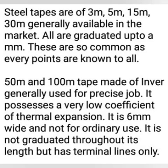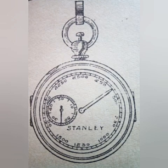To measure a distance by the direct method, we use a steel tape or the laser beam of a total station. Sometimes, a perambulator is also used for rapid determination of distances. All other instruments are obsolete. Yet, we have to know some instruments according to degree of accuracy. This is a passometer. It should be carried vertically in the waistcoat pocket or suspended from one of the buttons. It is operated by motion of the body and gives approximate results.